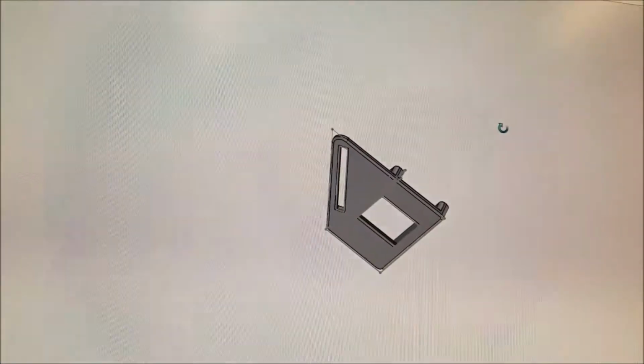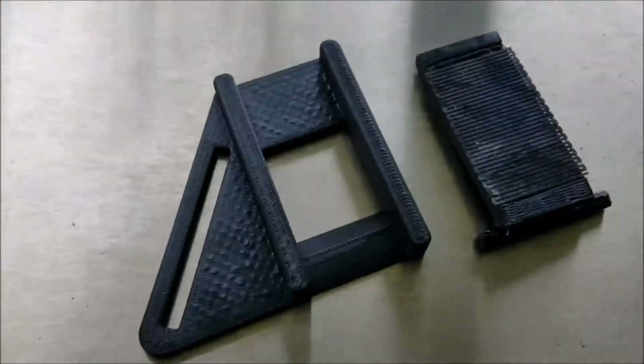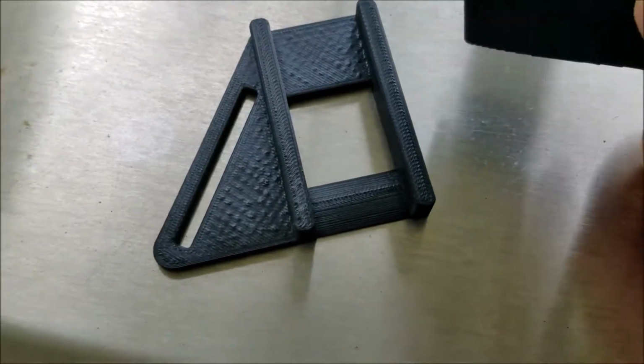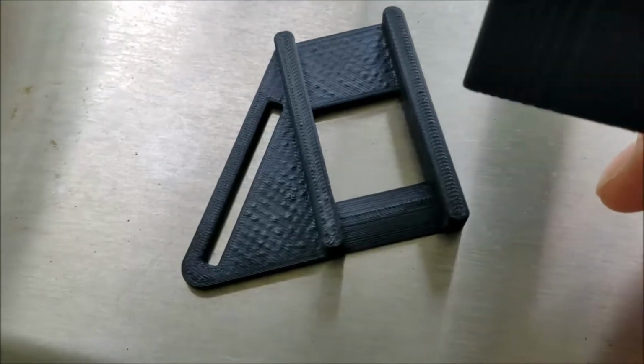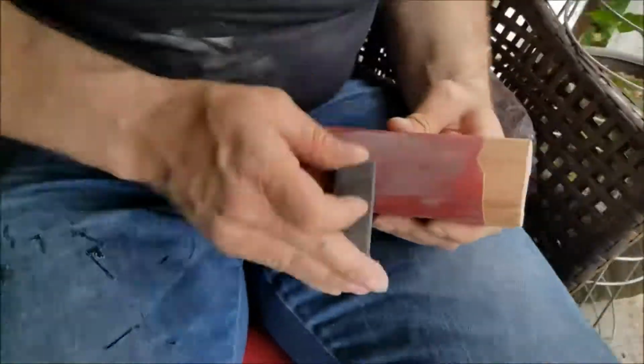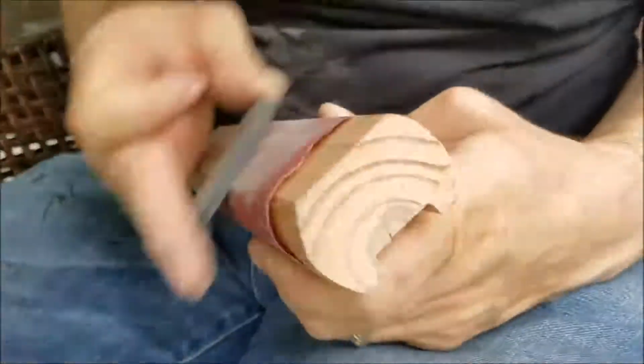First I made a model of the design in SolidWorks, and then had a blank 3D printed in the shape of each piece of the buckle that connects the belt to the pack in order to make a mold of it using metal casting green sand. Excess support material was removed and the surface sanded smooth.